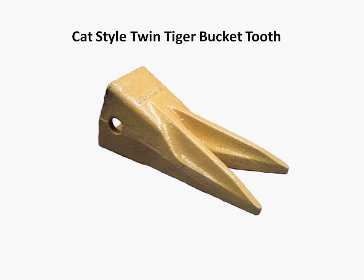Here's a tip about rotating teeth regularly: most teeth these days are designed to self-sharpen as they penetrate ground. This means that if you don't swap them around evenly, you're going to do yourself out of a lot of money. You can actually see on here where the arrow is — there's a beveled area on the tooth. That's the engineered self-sharpening. By more use, they get sharper, but of course they eventually do run out of metal and it's time to get them replaced.